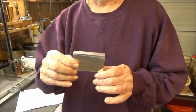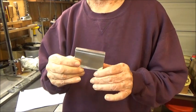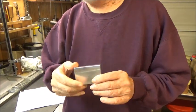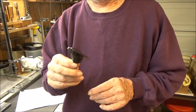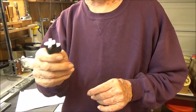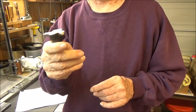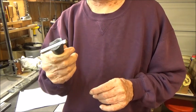On the last demo, I wasn't locking the Y-axis, so that did make a difference. Anyway, that's what it's doing on the aluminum. I used the same grind for the steel — it's a little steeper angle. What I'm going to do eventually is grind the other end of the tool bit for steel. But this works quite nicely. It will probably dull a little faster because of the steeper angle, but it works quite nicely.